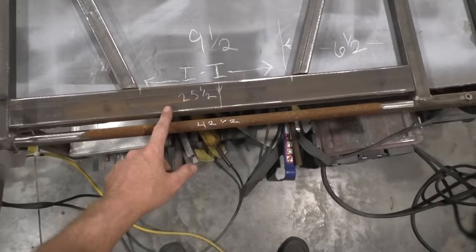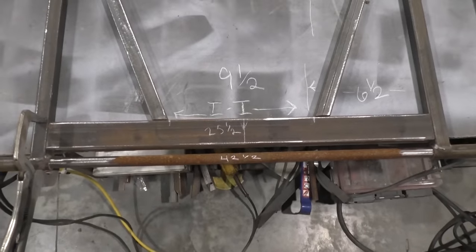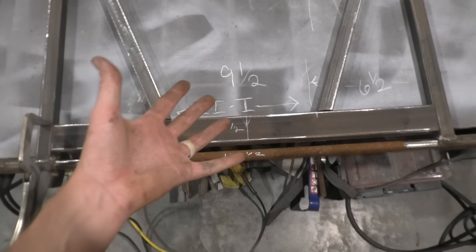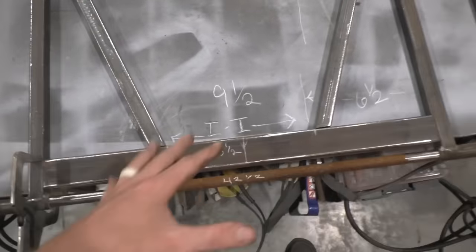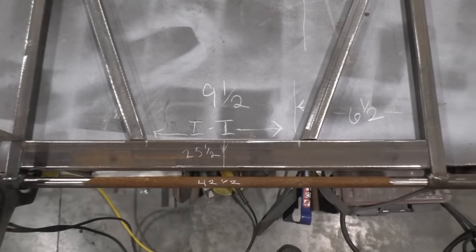The main structural piece is going to tie the two beams in together. So 1x2, it's like 11 gauge, about 1/8 inch thick. And you want that fairly thick because your cylinder's going to be pushing on that, picking up a 2,500 pound race car. Can't have this thing bending, people looking at you crazy when you walk by this thing. Are you kidding me? So anyways, pretty important piece. Make sure you don't slack on that.